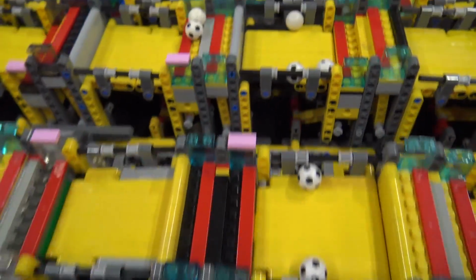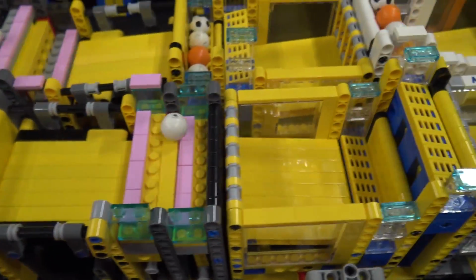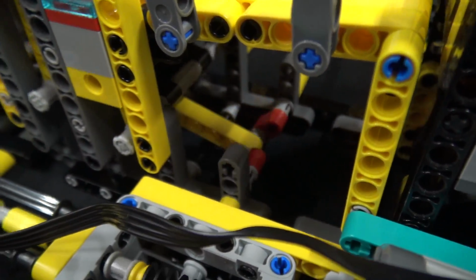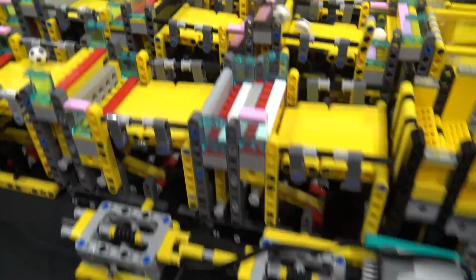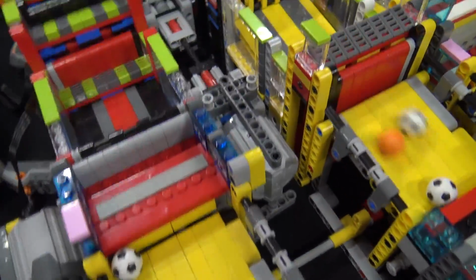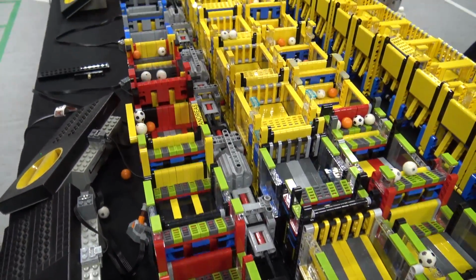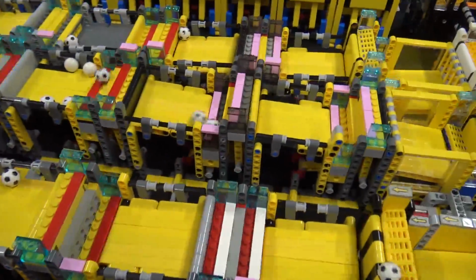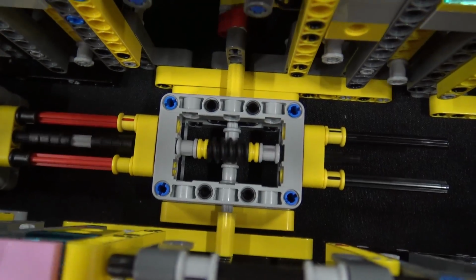And were these kind of an event kit for the show, or what prompted making all of these? Yeah, it started as a method to use only one motor for more than one module and create a kind of zigzag idea. With this module, you can use one XL motor to drive 10 pieces. If you look here, John, in the middle, you see a line of motors. And next to the motor unit, there's a driving unit. They both drive, in this case, 6. Yesterday afternoon we had 10 on one motor. It's very well doable. We will see more of this example actually.